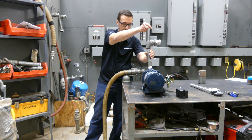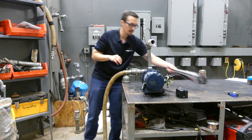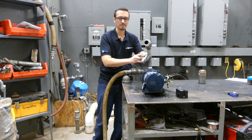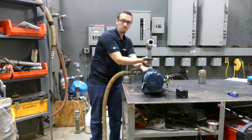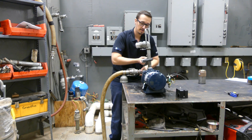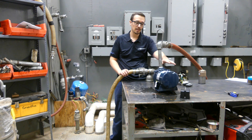Now that the pump is completely full of water, we'll go ahead and install the discharge — we have a quick disconnect on that too since we're in the pump testing area. You may need a wrench. Being extremely tight isn't critical when testing, whereas in a permanent installation you'd take more time to tighten everything up. As long as you're not leaking like a sieve and losing your prime, you're pretty much good. Inlet and discharge installed — ready to test.